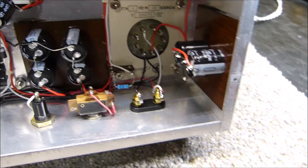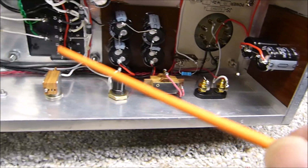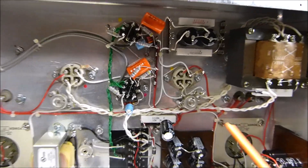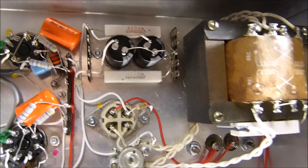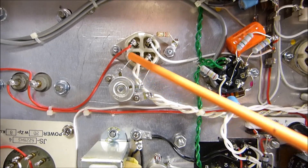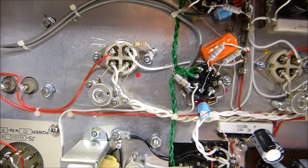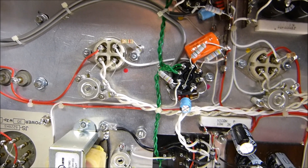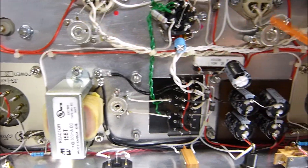Here's my negative feedback resistor — I don't have a trimmer capacitor across it and I'm not going to put one on. Here's the switch that turns the negative feedback on and off. Here are the output jacks, fuse, and power. Here are my cathode resistors, cathode bypass capacitor — cathode bias — and these are 50-ohm hum-balance pots originally from old Fender amplifiers. They work great; I've bought about 16 of them and used three in this amplifier.